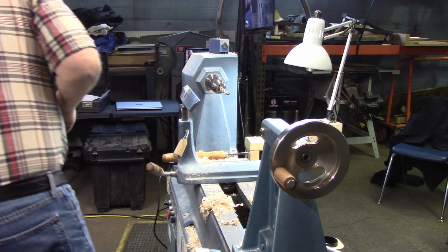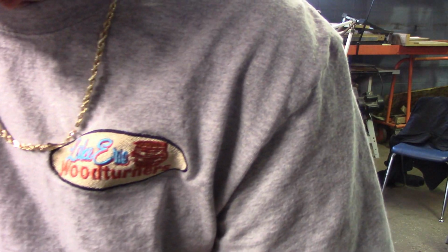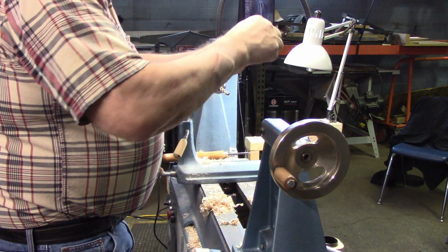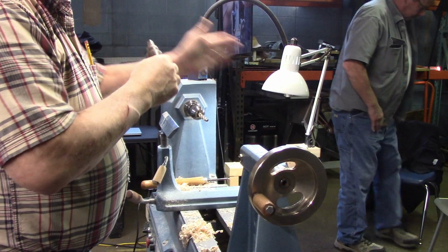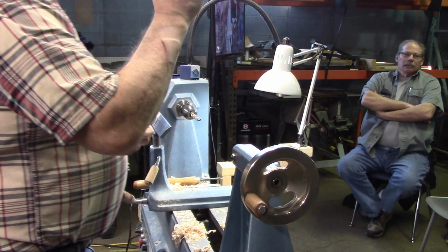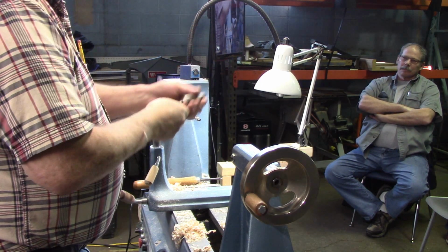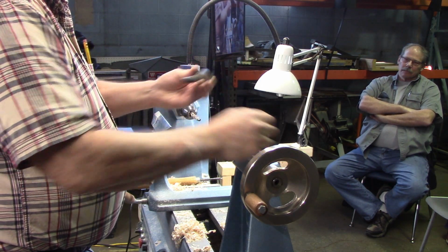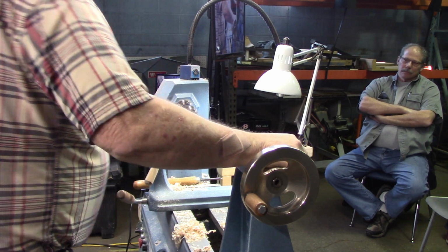Then, depending on what diameter it is, you can just put your cup center in that hole, and it'll make the axis that you want. If it's a larger diameter, like 5/8 for example, you can turn a plug with an end on it that you stick down inside there and put your center on, and pre-drill your hole first. Either way works just as well.